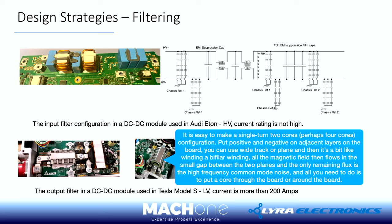But as you can see, now we're at a stage where we have new products, as Yegi demonstrated in the morning, such as a DC-DC converter, where you have high voltage but relatively low current, 400, 600, or 800 volts in a car. If you design, say, a 4 kilowatt or 2 kilowatt DC-DC, then you're talking about less than 5 amps input current. But on the output, you have hundreds of amps at 12 volts. So how do we cope with this kind of noise and huge current or big voltage?